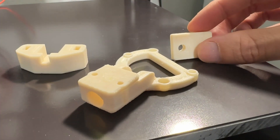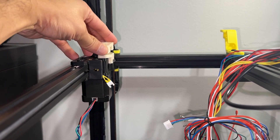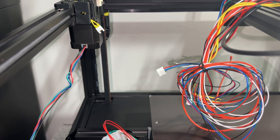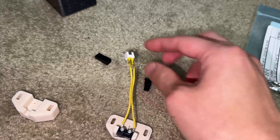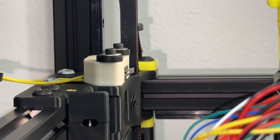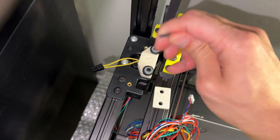I printed out some more parts to support the CAN bus setup. First change is this alternate Y endstop which sits on top of the motor housing — it eliminates the dead space at Y max. This made me shift my bed forward to line up with the Z endstop below. If you printed the original piece like I did, don't change it out until you finish watching this video. I'm going to replace the soldered JST connector with a crimped microfit since this part is subject to movement and solder can weaken over time, reducing 4 solder joints to 2.